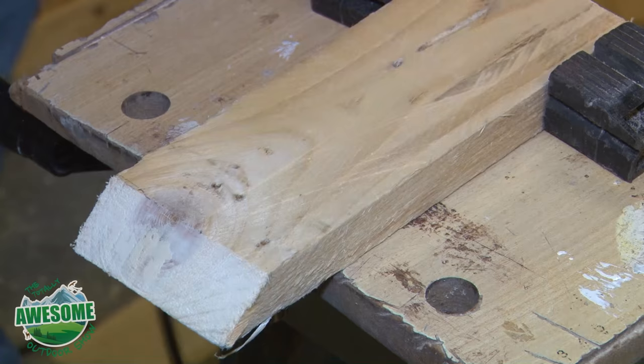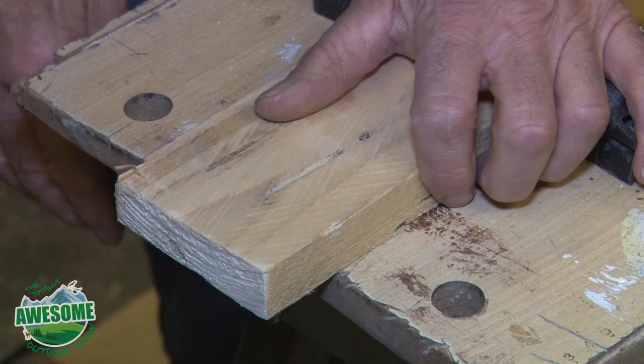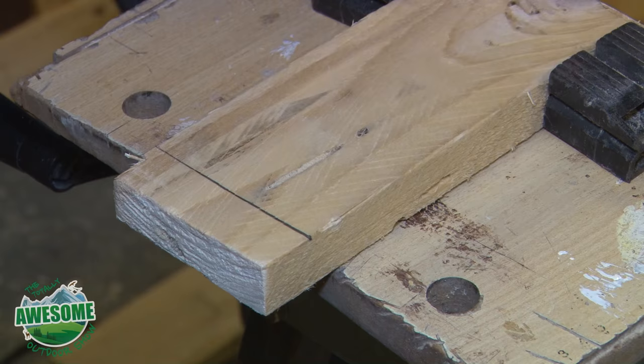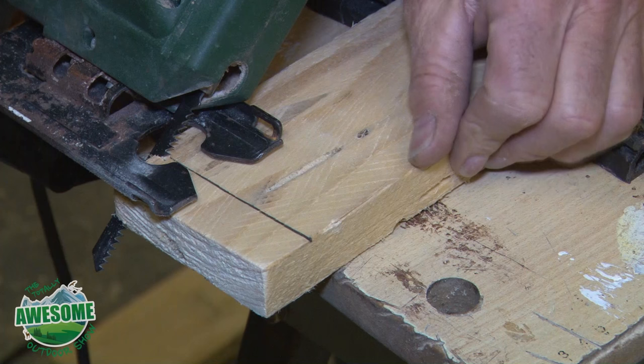There's a nice angle - all I have to do is sand it off. Turn it around, place it back, lock it with the blocks and the vice, get the exact width to marry up to, mark it with a fat pencil, then do the other cut - it has to be the same size. Don't force it, just let it go through at an even pressure.